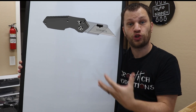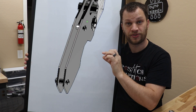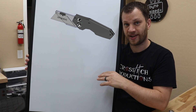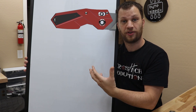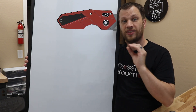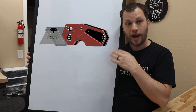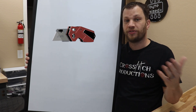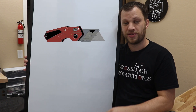The handle part in the back is also made out of about eighth inch stainless steel, but instead of being sandwiched close together, there are spaces in there that allow the knife to fold back inside. I'm going to need to find some spacers that are the right size. The final piece is the scales — the little outer pieces on the handle. What I like most about the design is that the scales have a cool industrial look with interesting geometric lines, and I want to replicate that. I'm probably going to 3D print these out of plastic, but you could also carve them out of wood, put your logo in, or have them laser engraved.